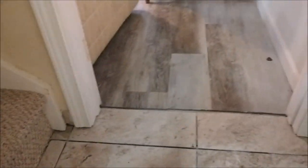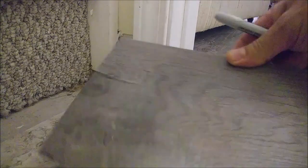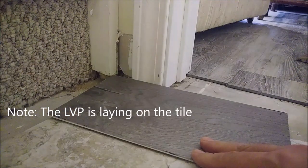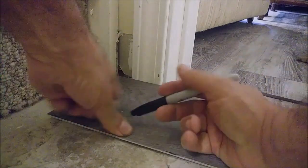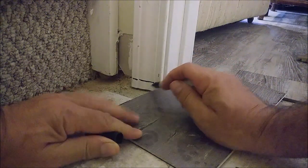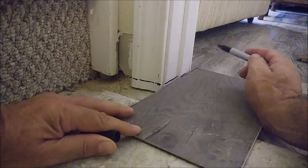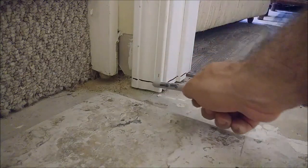So if you look at this video you can see how I did it. What I am doing here, as you can see, I am taking this piece of LVP that is actually one eighth of an inch height, and I put it here. That assures me that there is going to be a one eighth inch space between the tiles and the jamb. And here I mark it — the same thing here — and I mark it here.